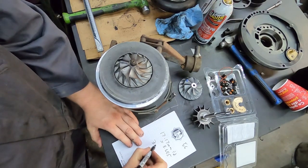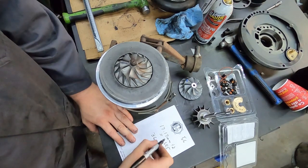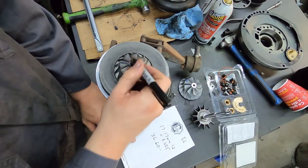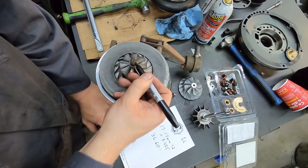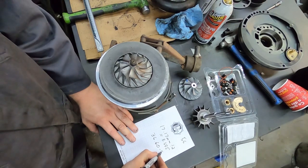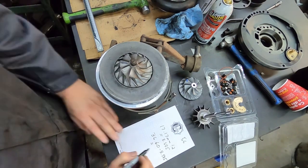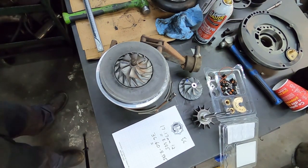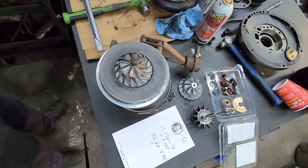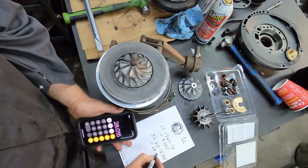So you have 36.6. Now what you need to do is take this number away, because we know the radius of the hub — we need to know the radius so we can figure it out. So 8.585. Let me grab my calculator — 36.6 take away 8.585 equals 28.015.